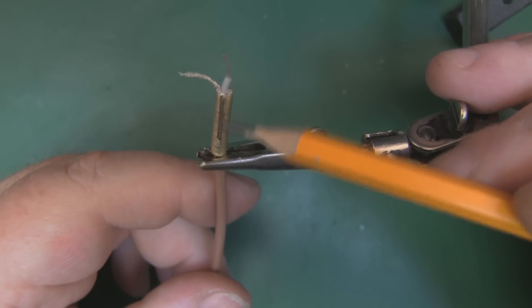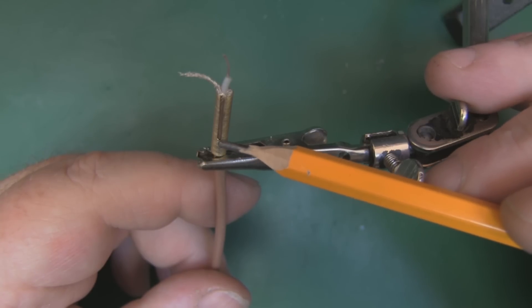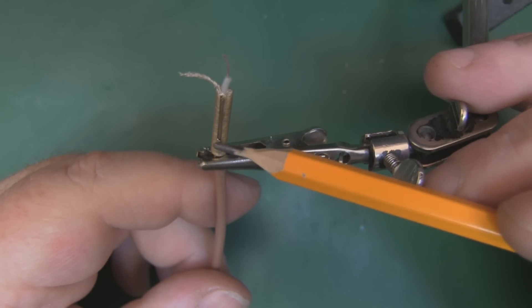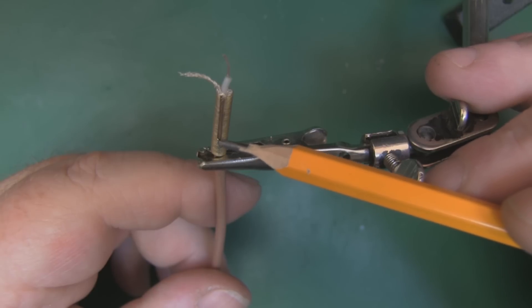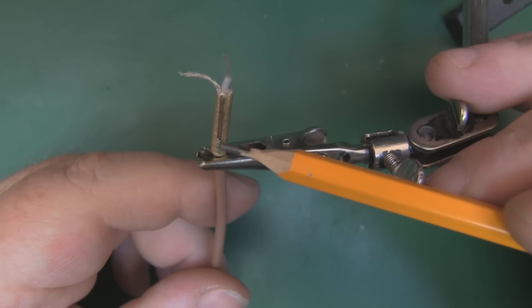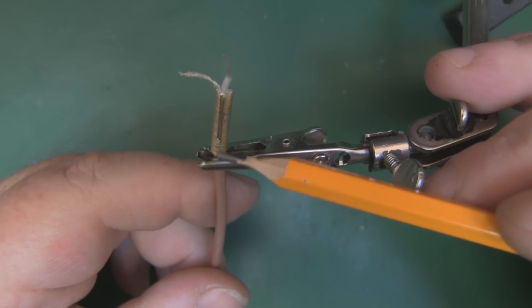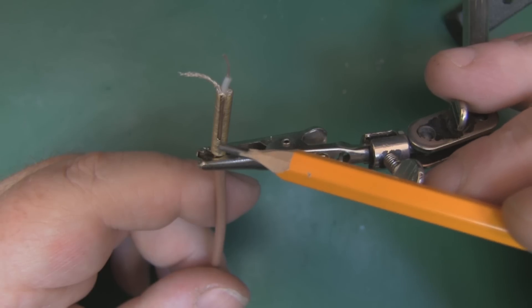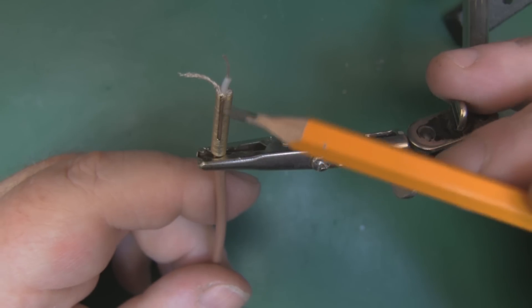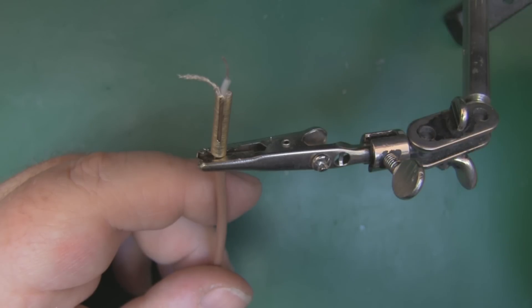The balun is ready to be soldered onto the coax. The slot is a quarter wavelength at 12.9mm, and I've cut the tube leaving 5mm from the end to the start of the slot. I'm going to solder this directly onto the reflector right where the slot starts, with about 4mm — roughly 1mm after accounting for the tin thickness — sticking out the back. I'll flood solder from the underside for a permanent connection, and flood some into the top to connect the coax to the balun.